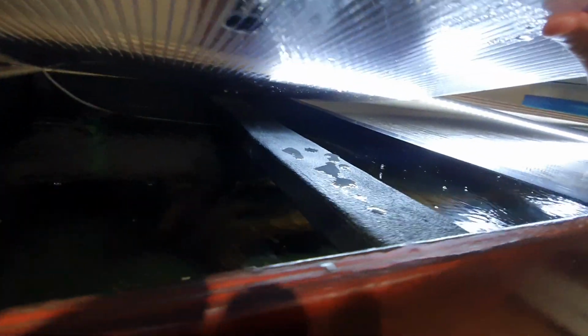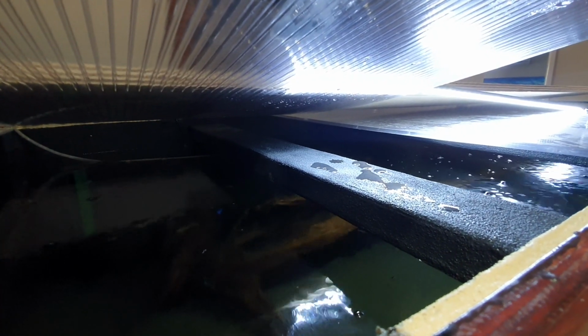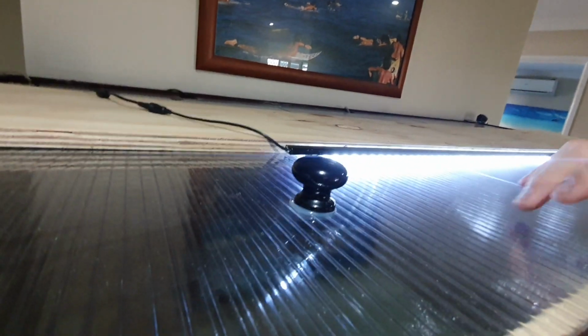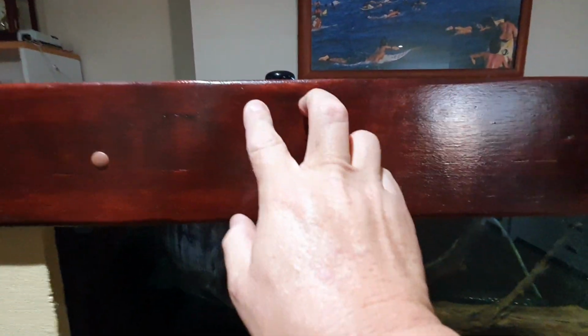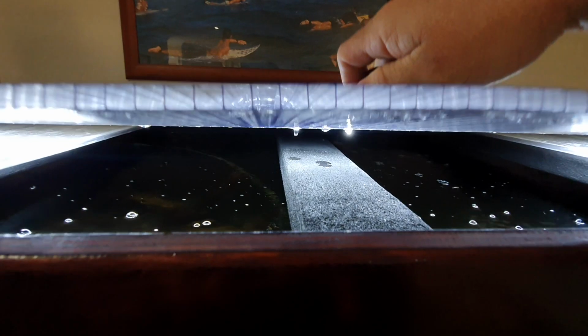Guys, that's your support. So, sorry we skipped video 3, but if you get that, that's just a plain 90mm by 35mm pine beam. And you just, one's got to go through there and screw into your, before this goes on. So behind this little frame is just your normal wood. So it screws through there, 2 big screws into that one, 2 big screws into that one, and that one.